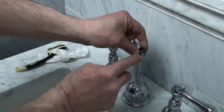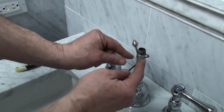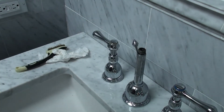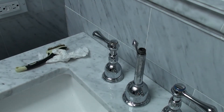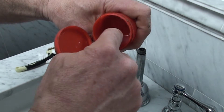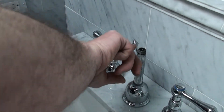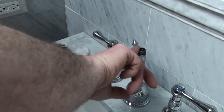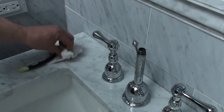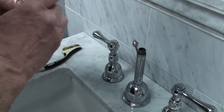The O-ring pick can also help install — not only does it remove, but it helps get the O-ring down in its groove. Now we're going to reassemble. I always like to put a little silicone grease — which is like a plumbing grease — on any new O-rings I ever install. It just makes them move better between the metal parts and acts as a preservative. So a little silicone grease, then we're going to put this back together in reverse of removal.